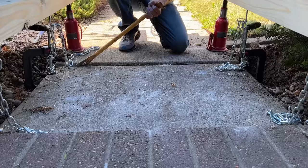Next up, with the use of some bottle jacks I'm going to raise up this section of the sidewalk, and then once I have it perfectly in place and where I want it, that's when I'll put the spray foam down to get a secure foundation underneath the sidewalk and keep it in that final location.